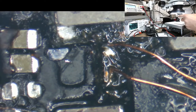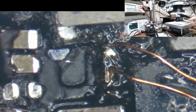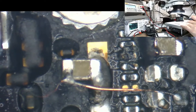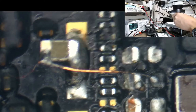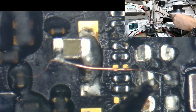Now, I have done jumpers before for backlights, usually when there's pads missing, usually when there's things that are not going to let this repair go right. But what we have here is jumpers and a diode that's sat on top of the CPU. We've got a capacitor here that's been soldered to the ground plane and a jumper. See this here, if I just show you that there, I have unplugged the battery, we're okay. That capacitor there should be there.